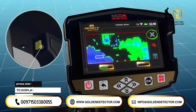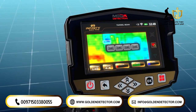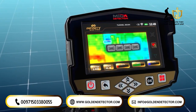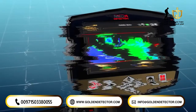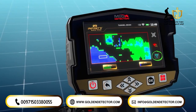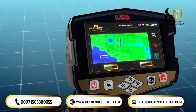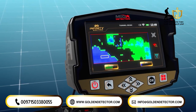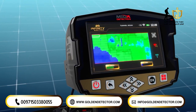Note, the user can press the Start button on each cell to display the exact result value for each of the MGS 60 built-in sensors on the results screen. Color filter. Use this option to hide or show the green color, representing normal ground. This is useful for showing areas of the scan that include metal targets or voids.